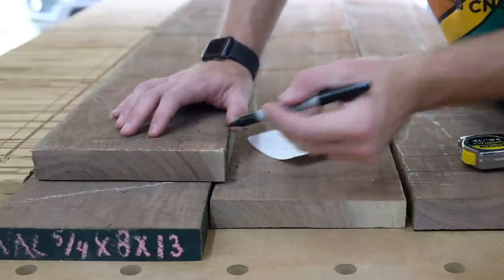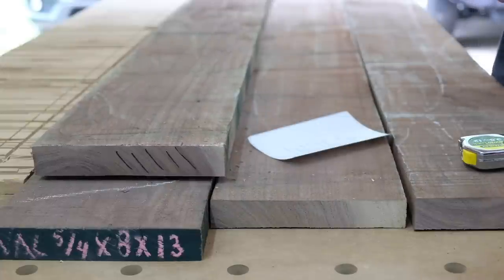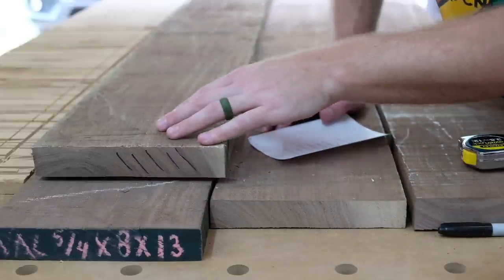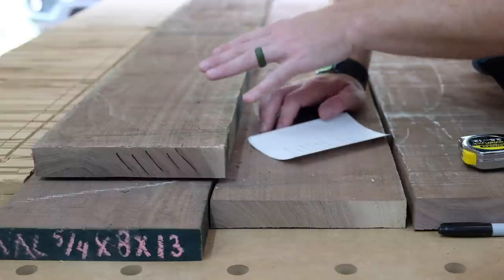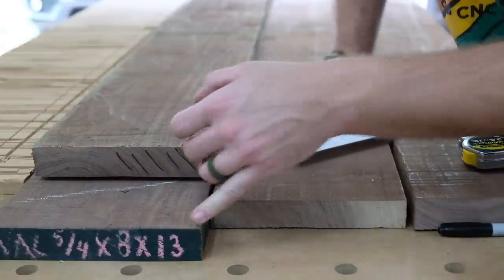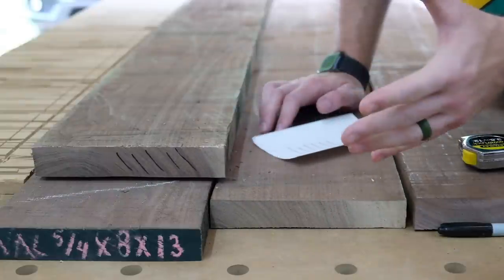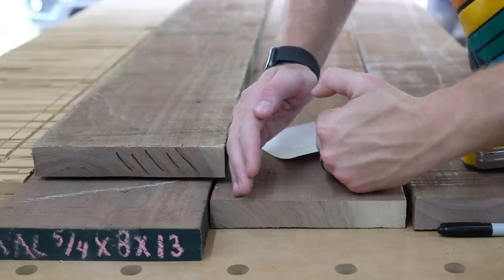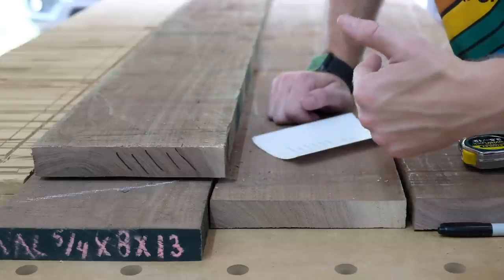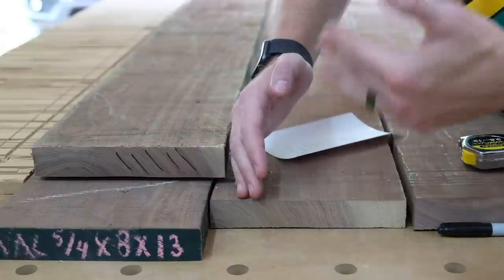Here's a better view of the type of grain we have here. You can see that the grain is running up like this, so that's quarter sawn material, which is always desirable. At least in the projects that I do, I try to get as much quarter sawn material as possible. So this is a five quarter board. I have three of them and I cut them at eight feet and five feet because they were 13 feet long. You can see this board is labeled as such: five quarter, eight inches wide, 13 feet long. These boards are between seven and a half and eight inches wide, which is good because my case is going to be six inches deep. That gives me some wiggle room across the width of the board to avoid things like sapwood or knots, as opposed to choosing a six and a half inch board — that's not much room to move, especially when you consider you have to joint edges as you go along the project.